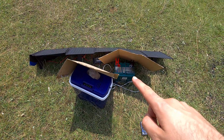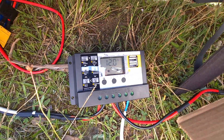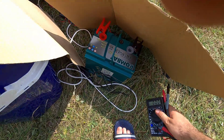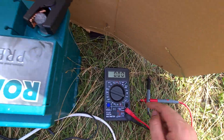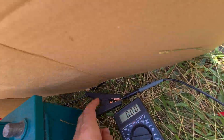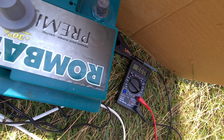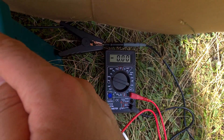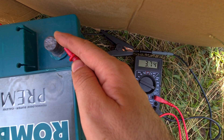The battery is not really charging — I have direct sunlight but the battery is at 12.0 volts, barely charging. Let me measure the amperage. I set the meter to amp meter, disconnect one wire, connect it in series. One amp... three amps... four amps — the battery is being charged with four amps.